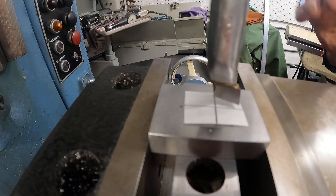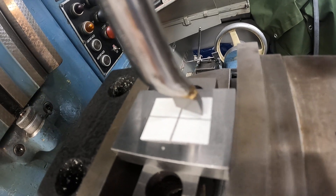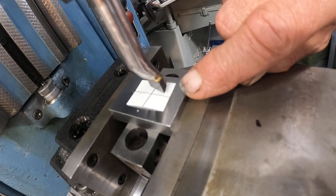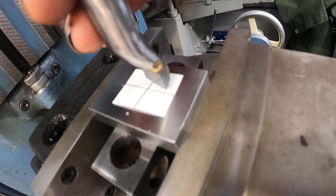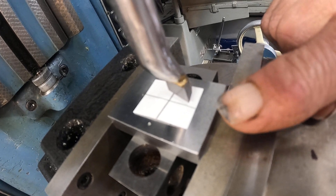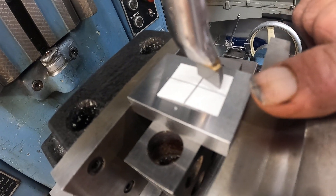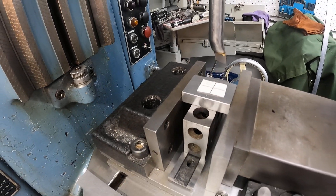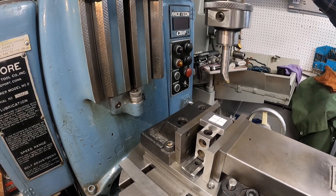You can vary this a little bit. When you're cutting, there'll be a little bit of torsion and it will cause the point to fall behind the center line. So you can move the tool where it's mounted — leaving this square — and put it a little bit ahead of the center line. Sometimes that's good to do if you have finish problems. That's a good way to align the tool.